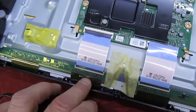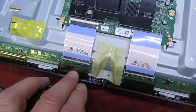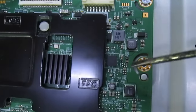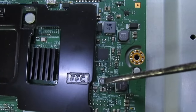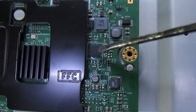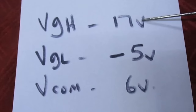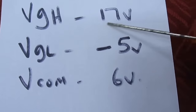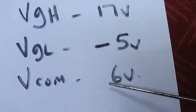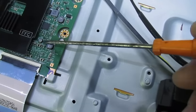That tends to suggest that one of these chips isn't actually faulty. Rather, a supply to one of these gate drivers is missing. Here's where it gets more technical — we've got three inductors there, which tells me there are three supplies to the screen. Disregarding the incoming 12-volt supply inductor, these three generate the LCD bias voltages: VG high (17V), VG low (approximately minus 5V), and VCOM (about half the 12-volt supply, so approximately 6V) — three different bias supplies as indicated by the three inductors.